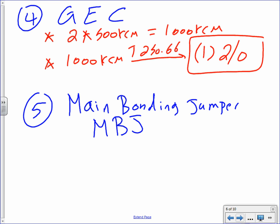Now, do you remember yesterday when I showed you guys the grounding bar right at the ground? That's where that conductor goes, tied to that grounding bar. Everybody understand where that conductor goes? Why one of them, even though we parallel 2? It's only one conductor going directly and tied to this. It's not going in the conduit by itself. Did you guys see that grounding bar and the 500 kcmil ground ring that they did around the building? I hope that will make you appreciate the bonding and the grounding that we're doing.